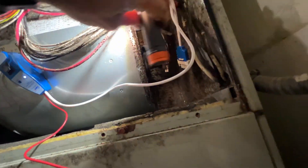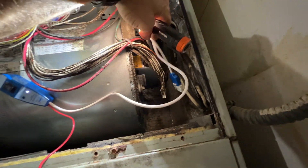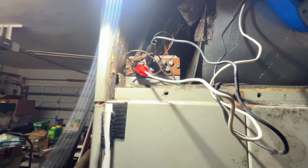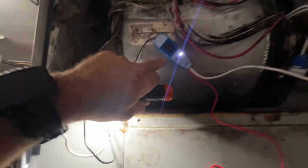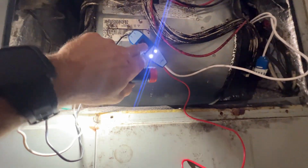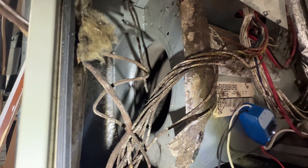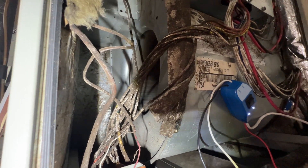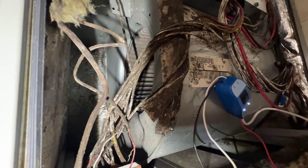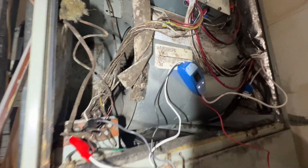So it's really easy. You just hook up — take off the 16-pin harness, hook up the connector with the 16-pin, 24 volts and common. Just grab that off the terminal strip. You got power here, flip the switch. And that's the same thing it was doing when it was connected to the controller. So that's how I determined the motor was bad.